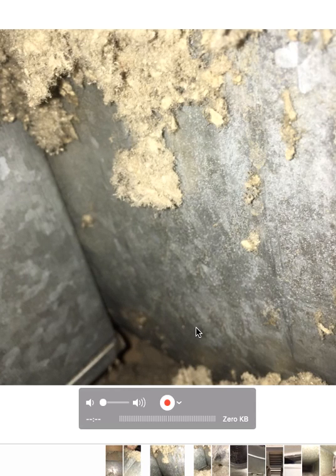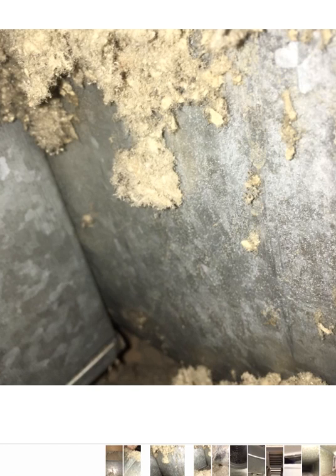Because you might look at that and say, I don't know how much air would really leak out of that. I'm going to show you a picture that's way more indicative of it because it had a swamp cooler, so it really did damage to it. That's a picture you should take when there's a trunk line you can access. It's a 90-degree turn there — definitely air leakage.